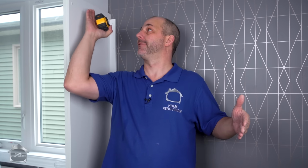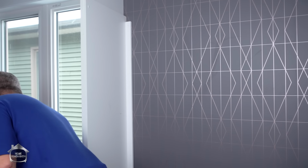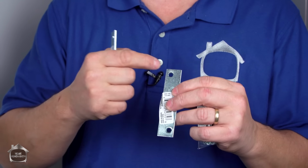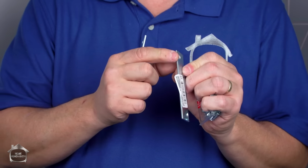All right, so now the key here is to understand that we're going to need some gable support here, and then a shelf to go from this side and then tie right into the other shelf. And I bought a couple of mending plates for that. Here they are. You can buy these mending plates at the local store, and the top of the hole is beveled out so that the screw sits right flush in there. So we're using 5/8 screws. After the thickness of the metal, they won't penetrate the bottom side of the shelf, okay? So you can stick these on and tie everything nice and tight together. It also transfers weight from one panel to the next, which is brilliant.